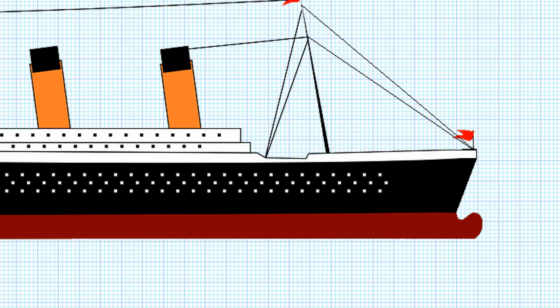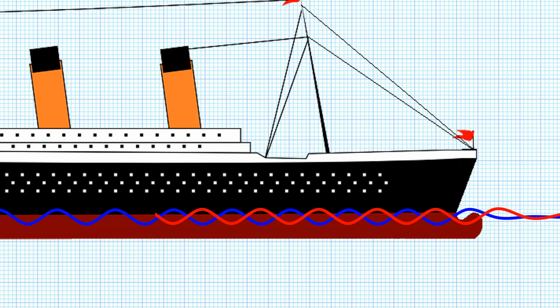This is going to affect the way the water moves around the hull. If we think back to the original waveform, I can overlay it here in blue — this is the effect that the hull itself has on the water flowing around it. But we've now got this additional bulb at the front, so I can overlay the waves generated by that bulb alone in red.